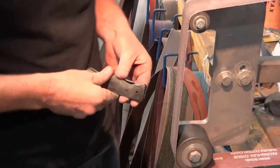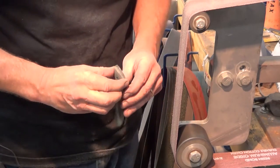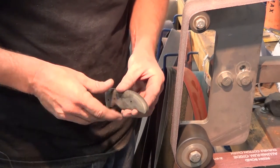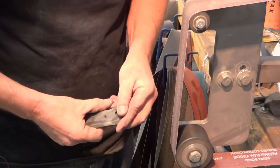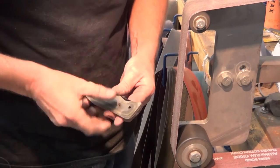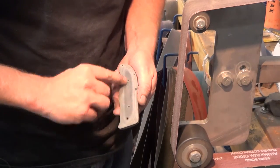What I was doing is checking the thickness on the first scale, getting the thickness to match it all the way around just by eye. And then also I wanted to get the relief pattern. Now there's a little bit extra for the lock bar and the thumb stud, so that's contoured in a little bit. But I want the same kind of looking pattern all the way around.